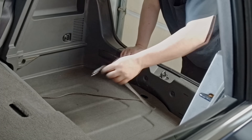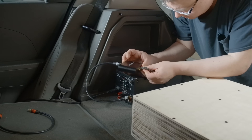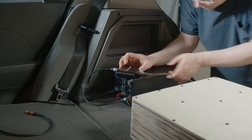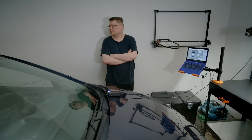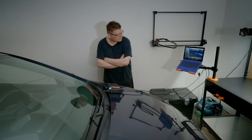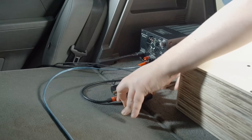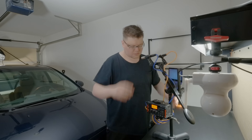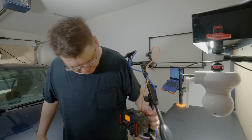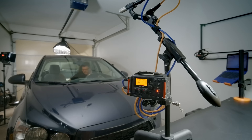And since I still have these RCAs run from the head unit, I can just plug into the DSP, sending 38 to 80Hz through the reference amp to the sub, with everything else coming through the car's speakers. I will, however, bypass this until after the frequency response test. And things continue to line up as expected. Though, if there's one thing that continues to stand out, it's the forward-sounding character of the lows, and how effortlessly they carry even beyond the immediate listening space — so much so, in fact, that I elected to include a mid-field vantage point for the in-car portion of the demo as well, with the microphones set up on the bench. Once again, starting off with the upright bass.